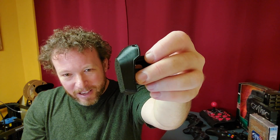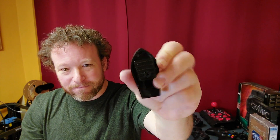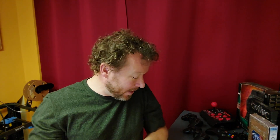It worked! There it is — the Banshee with the homebrew nozzle, the Elegoo stainless steel nozzle in the hot end of an SV08. Not perfect, has a little issue here and some nonsense there in the front, but it printed a full Banshee at acceptable quality. With the brand new nozzle, I also set up the printer appropriately to my actual filament — I went through the whole Orca Slicer calibration procedure, and that helped a lot.